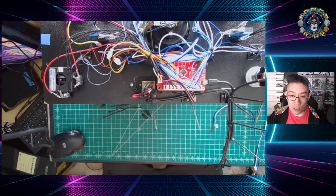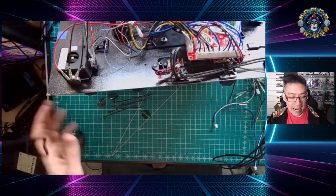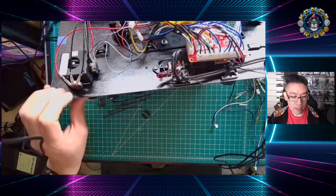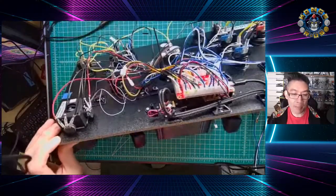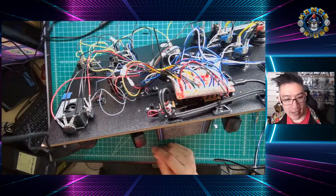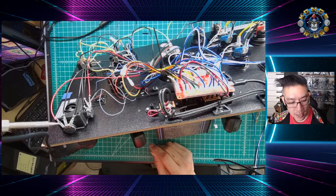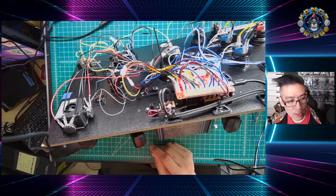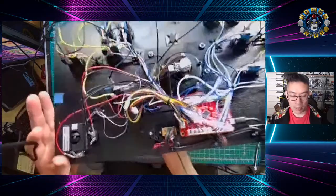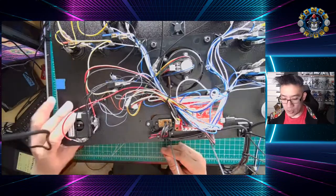The other thing that I personally do, since these connections here are a little bit loose, you can see they kind of bend, is use a soldering iron and solder these portions down too. But that's just optional. I have a soldering iron right next to me here that I'll take and use some solder to make sure these stay on securely as well. So that's an extra step that I personally do. You don't have to, but that's just another precaution, because I want to make sure it's secure and doesn't move around and fall off.